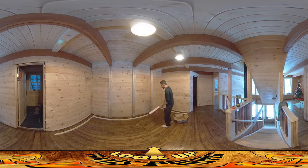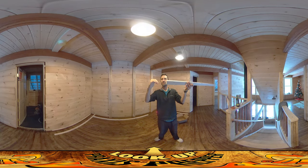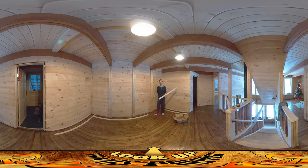I'm putting in this last piece right here in this corner, and I wanted to talk about what I'm doing — trying to get it so you don't even see a seam here. Instead of cutting these at perfect 90-degree right angles, I'm cutting them back a little bit so the two tips face out, kind of touching right in the front. That's a great way to get a really tight seam: taper it back a little bit. As long as you're not going to see the top of it, you'll never know, and you can slide those things right up next to each other. I did the same thing on all the seams in the floor — tapered them so the floorboard tops touch with a little cavity in the bottom that you're never going to see.